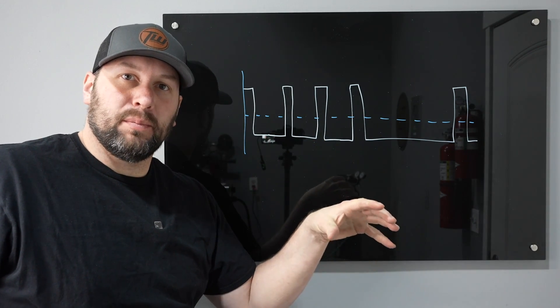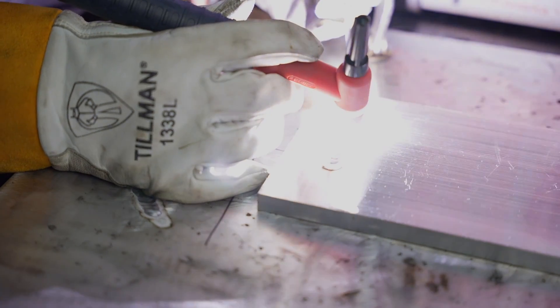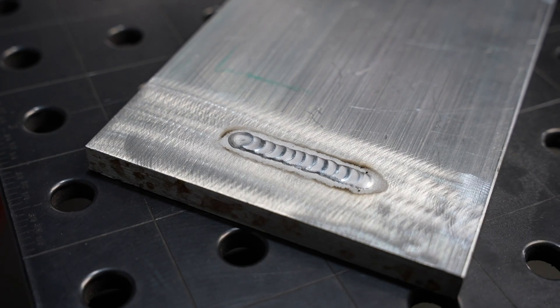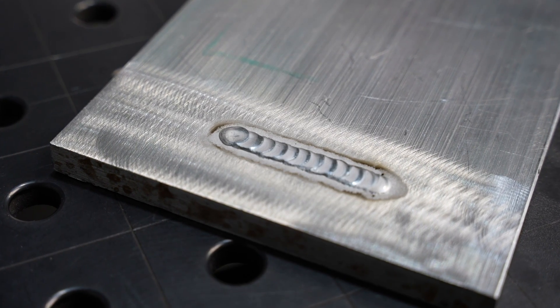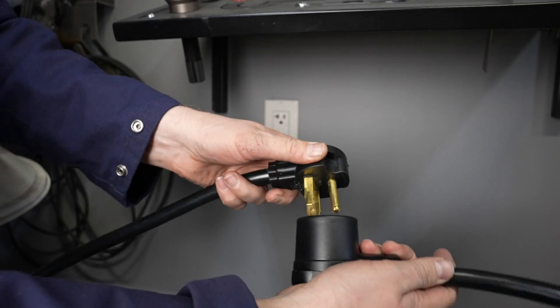You can set the percentage of time that it's on DC — up to 30 or 40 percent with straight argon, or quite a bit higher with helium. If you're welding this thickness all the time you probably want to look at the Invertig 301 or 400, but if you just need to do it occasionally, this can get you through.